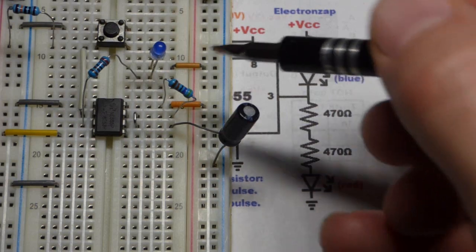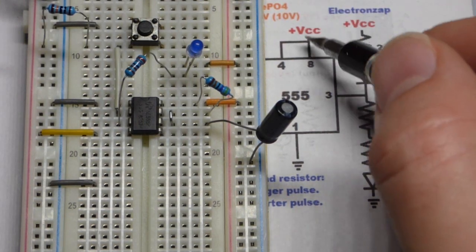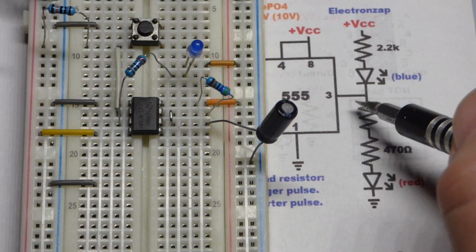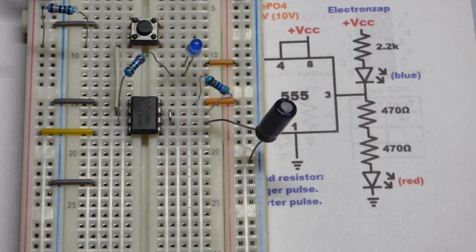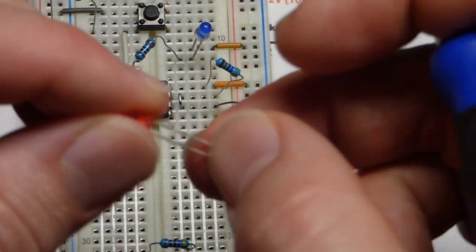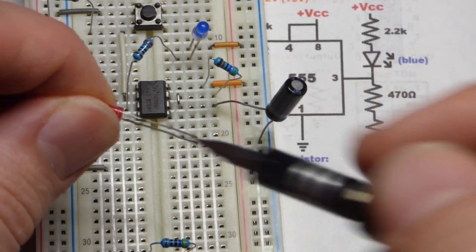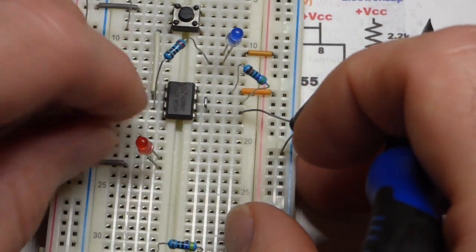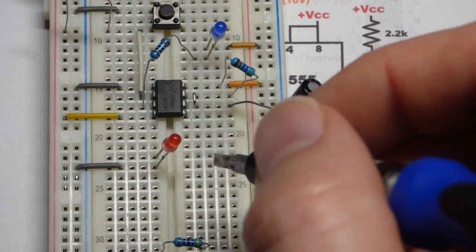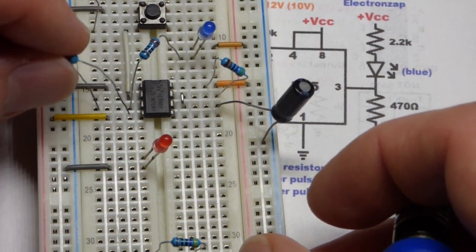Now for the red LED — it lights up when the output is high. The output won't quite reach full supply voltage, typically falling about a volt short, but it's enough to light the LED. The anode is the long lead and the cathode is the short lead — some LEDs also have a flat on the cathode side. A jumper connects the cathode side down to ground.